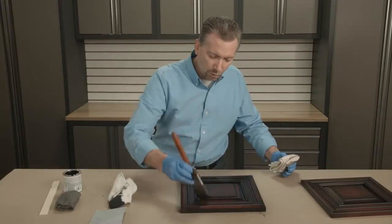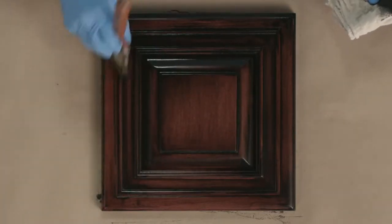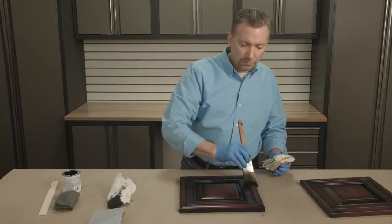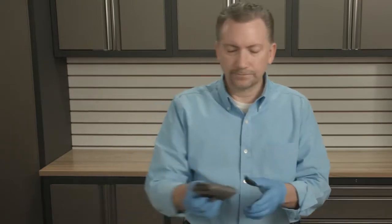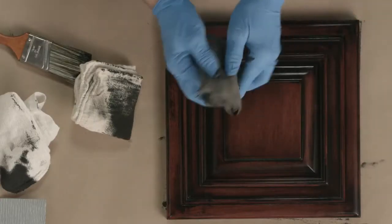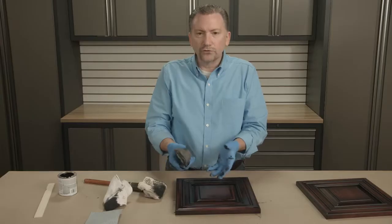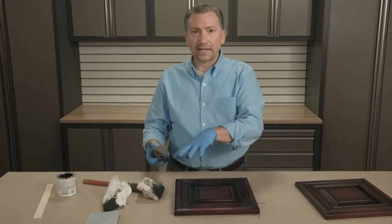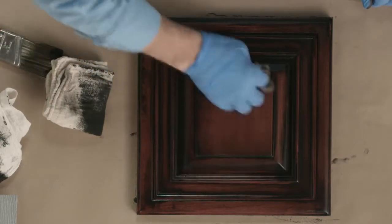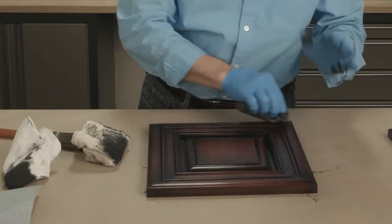Once I've achieved the color that I want, I'm always brushing in the direction of the grain and making sure that I'm pushing the stain in all the crevices. Once that's done, I'm using a product called steel wool that can be acquired at any hardware store — it typically comes in a roll like this. I ball it up and gently concentrate on the center portion of the panel, because all I want to do is pull out the undertone color, leaving the natural burnishing of the second stain that I applied. I'm working in the direction of the grain, taking off exactly what I want.